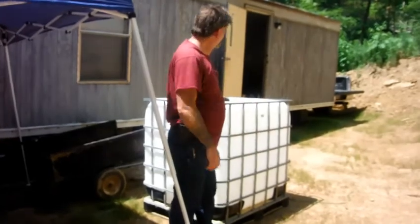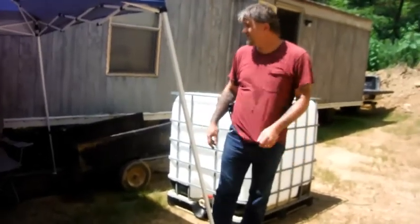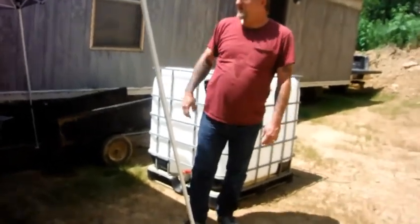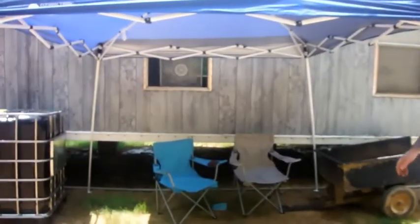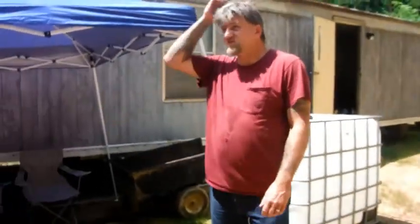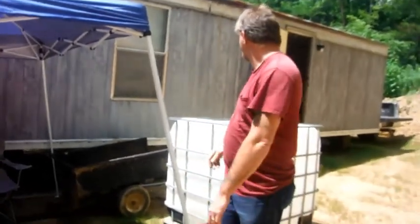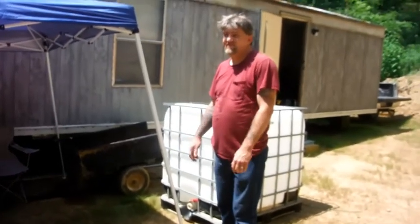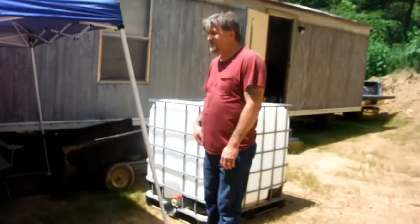We're going to have a septic system put in here. It's going to be run off of rain barrels and solar. But you can see the fan running in the window now. There's power here now. I've got it run through just 12-2 wire from the inverter on top of the hill down to the trailer. Just enough to run everything 120 in here, just like it's sitting in the city hooked up to the power.